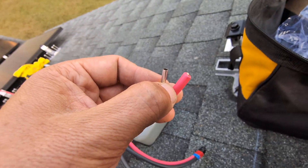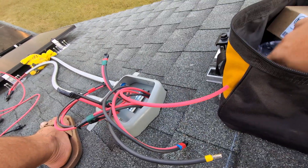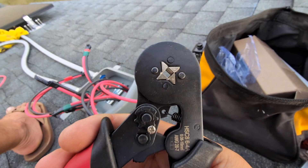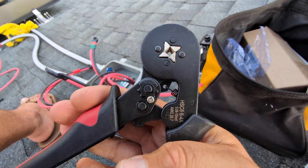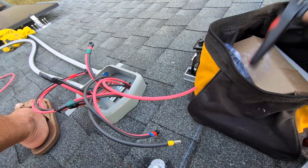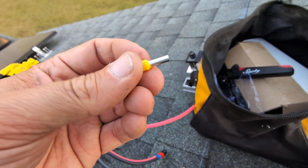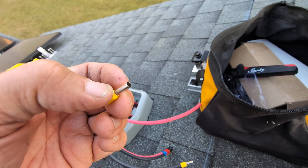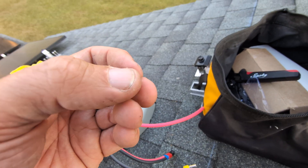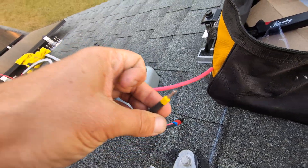You can see all the strands squished together, nice and square, so when you compress them into the DIN rail they'll be nicely fitted. I strip the wire jacket, then use this crimping tool, which is a four-directional crimp — each direction comes in at the same speed, applies pressure, and crushes the ferrule onto the wire. Slide the ferrule onto the exposed wire making sure all strands are inside, slide the tool over it, crush and crimp it, and it turns into this finished end here.